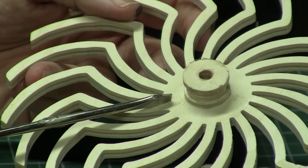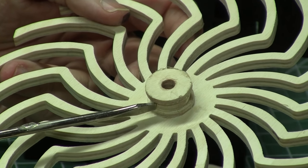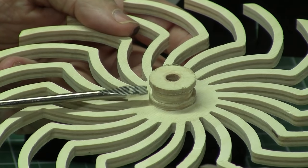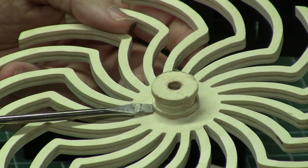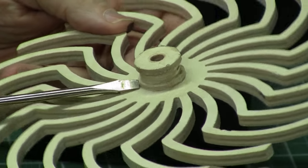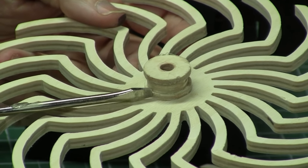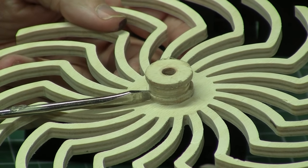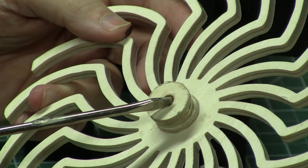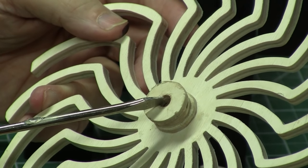On the back of the first spiral, we've got this little drive wheel. What it is — it's an eighth-inch piece of Baltic Birch plywood, a quarter of an inch, and an eighth of an inch, to make a wheel that has sides on each of it. That is to trap the drive belt, which will be a rubber band, in this little groove right here so that it can turn. This hole right here has to be larger than the shaft that we're sliding the piece on, so that it rotates freely.